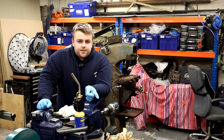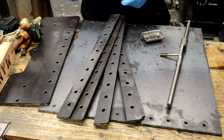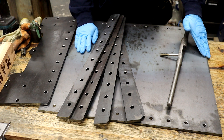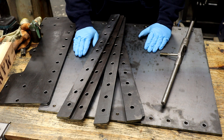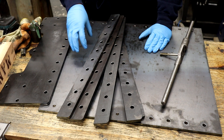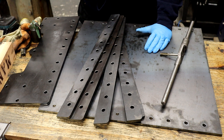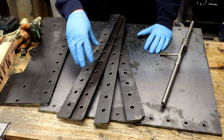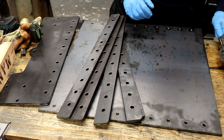So here's what I've come up with. We've got a 600 by 600 by 10 millimeter S355 mild steel plate — this has been cut via a laser cutting machine. We've got the 10.2 standard M12 tapping size on the base, and then 12 millimeter through-holes through these plates.